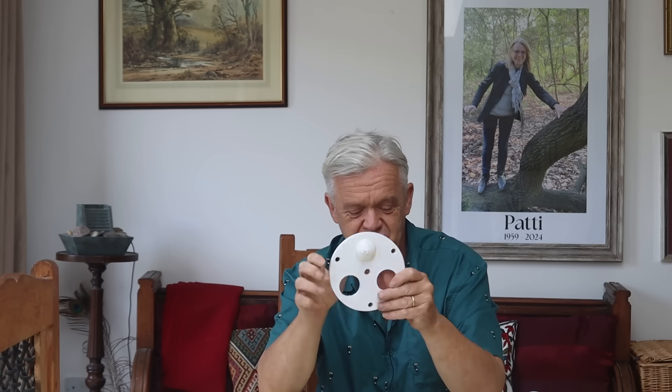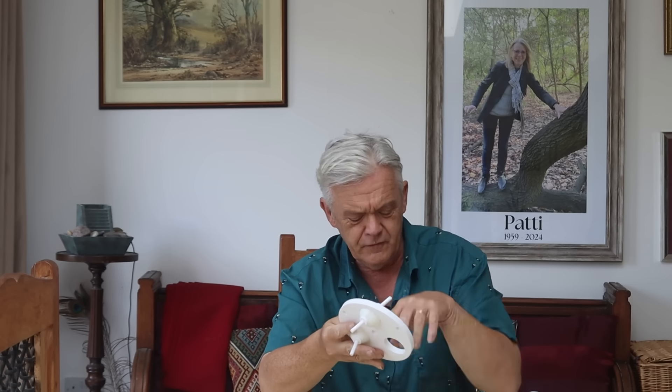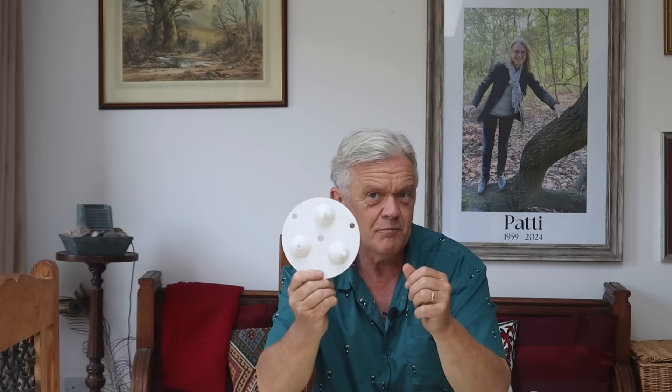Once you've done that, that's what we get. Now we're going to need this plate. This plate has three holes to take the ping-pong balls and they have a slight bevel on them to hold the ping-pong balls in place. To put them in they're just a press fit — you give them a good hard press and they'll pop into that space where they're free to turn in any direction. We put all three in there. The NuVinci suggests somewhere between three and twelve — we're using three because three's just fine. That plate forms the heart of the NuVinci. We've got to put the other structures around them and to help do that there are three pegs which just press into the plate to create the holder for the actual spheres.